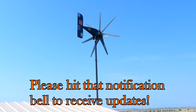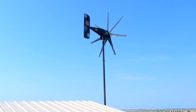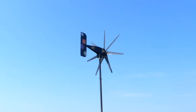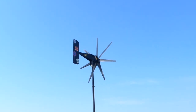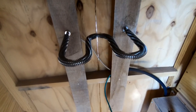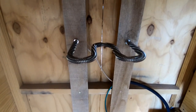And another thing you can do is heat space. And that's what we've done here. Because as I said, Buzz is not insulated. It's going to get really cold here this winter. Batteries can drop as much as 60% of their efficiency during cold weather. And so it's in our best interest to keep these batteries warm. So we've opted, at least temporarily, to install what they call a dump load resistor into the trailer there that can generate heat and keep the batteries nice and toasty.